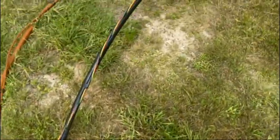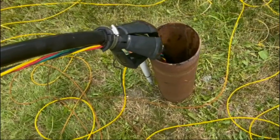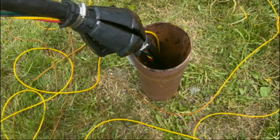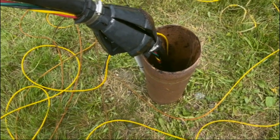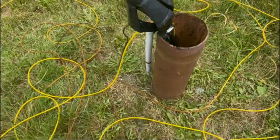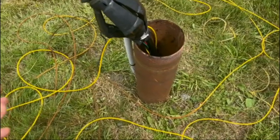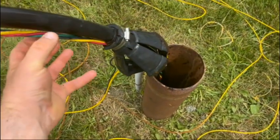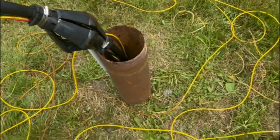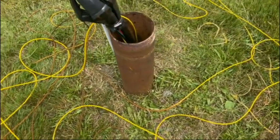And then we're gonna come back up around, and up, and then back to the well casing, we hit another torque arrester. I think I'm almost at the pump. So, took another quick break. It's not real heavy, but this is why the professionals and the plumbers have a rig that sits right on top of the well case, and it's got three wheels on it, and the wheels clamp right around the pipe. They're just rubber tires, and it's an electric motor, and then all you gotta do is walk around in a circle and guide the pipe and lay it out. The machine does all the lifting, but I don't have one of those.